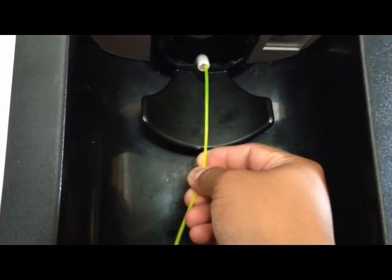When you break up the ice, to prevent this from happening again, push the weed whacker line in — about a foot — and leave it in there. If it ever freezes again, you can just grab a pair of pliers and pull that weed whacker line out, and it'll break up the ice.